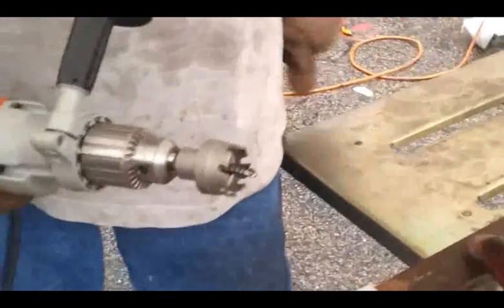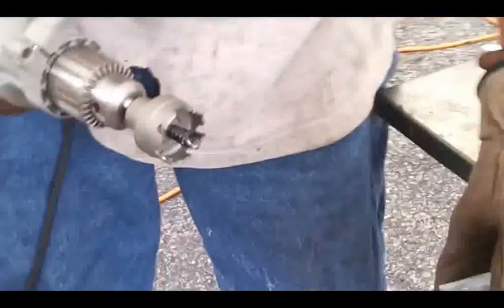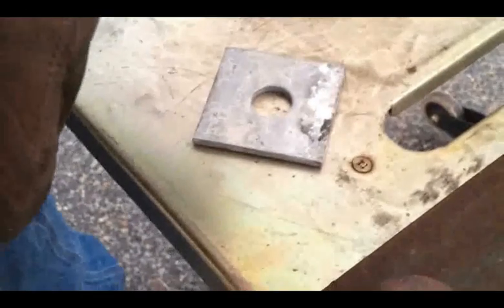What we have here is a tungsten carbide tip cutter — a TCT. This is basically a one-piece hole saw that has tungsten carbide tips welded on it. They're great for repeatability. What we recommend is first of all lubricating your piece of work — it extends the life. Secondly, place a washer underneath where you're going to begin your cut, so when you plunge through with your pilot bit, your TCT cutter tips don't bind and break the pilot, nor do they snap the tips off the cutter.